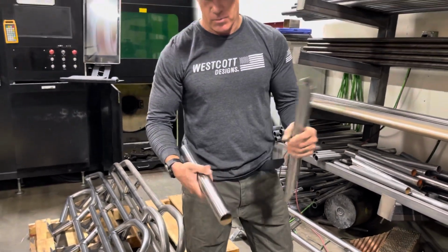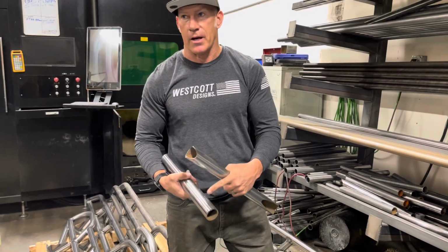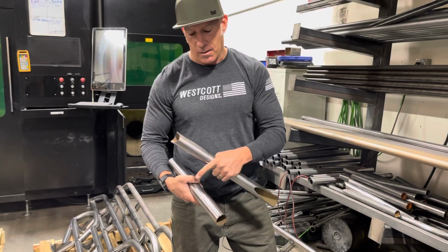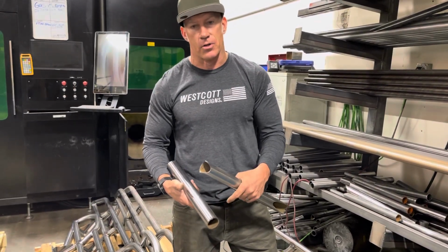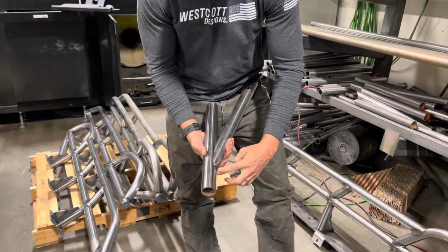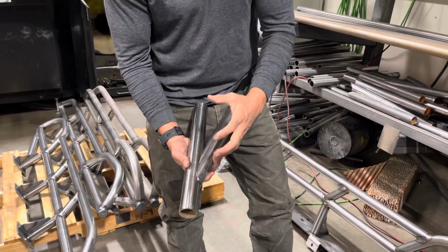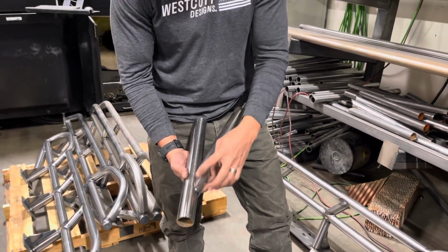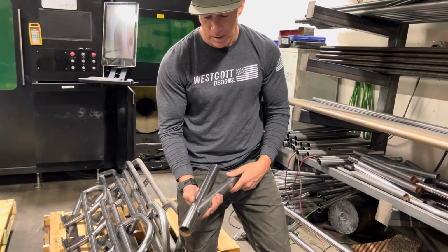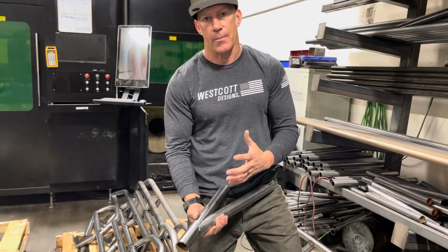A lot of companies clean with a grinder only around the area where they're going to weld, and then weld their part around it. The problem is that when these two pieces are butted up to each other and you add heat, the weld pulls those oils into it, so it doesn't make as good, strong a weld with the contamination of oils getting into it. So what we like to do is clean everything, even our top plates that we put on.